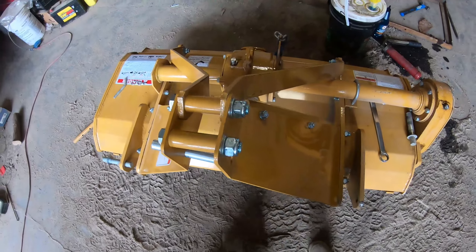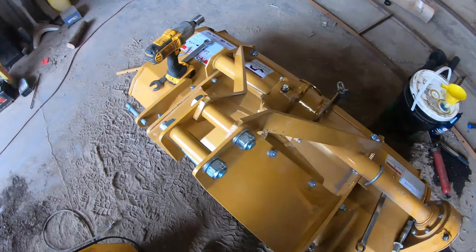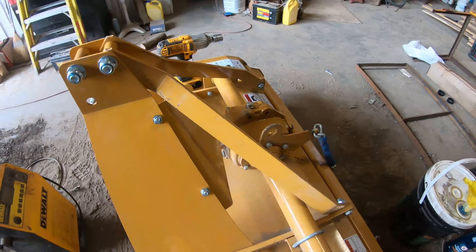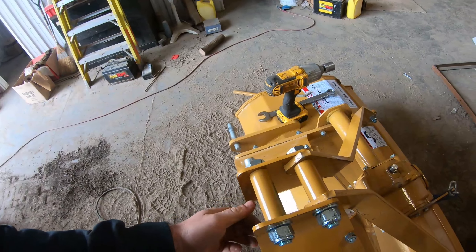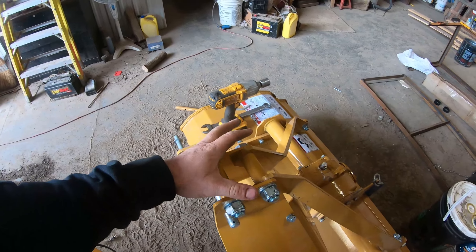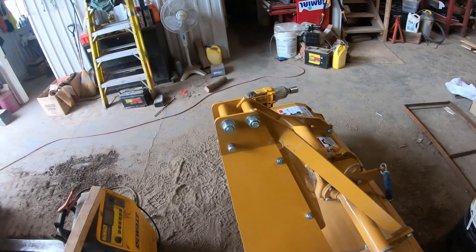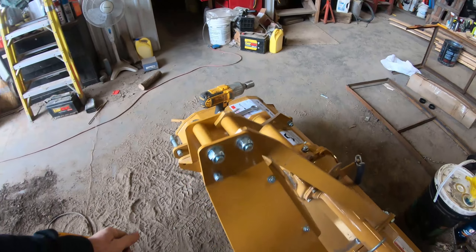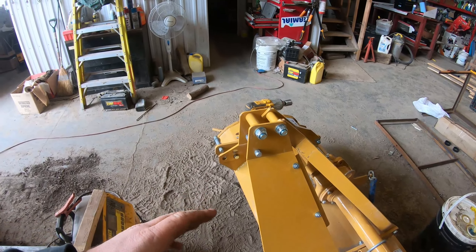You'd think I'm an engineer coming up with that — you guys just didn't see all the blueprints and diagrams and theories I had laid out before figuring this out. But we got it, and that's what matters. Now, you might think I'm tightening these really tight, but these things shake and bounce a lot on the tractor, so I like to make sure everything is really snug. It's also good to periodically check the bolts — I did a once-over and both rototillers had some loose bolts.